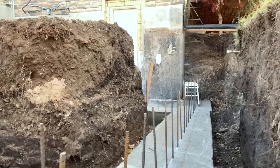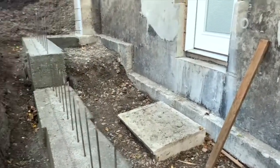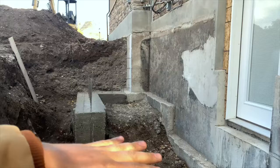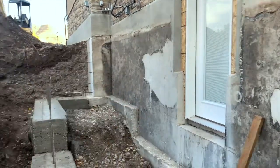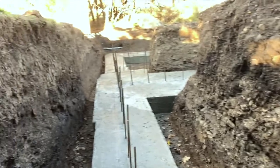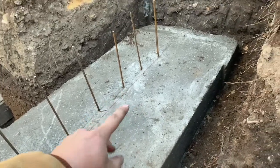This is the basement walkout portion over here. Basically this is the new wall that we're putting in — the new footing that we've got — and this is going to hold and tie in where the stairs go. I've already got the stairs marked out on this wall. We'll put another foundation wall on top of these footings, and then we'll look this way and show these dead men walls here.